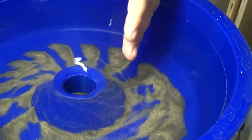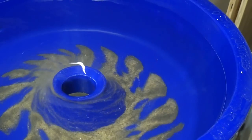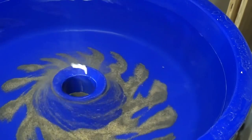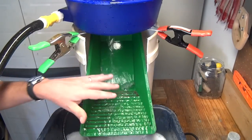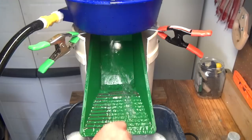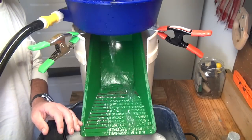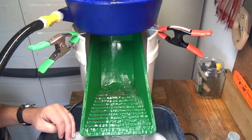You can see the material coming up the cone and out — that's all the lighter material. All the gold will stick around; matter of fact, there's a piece of gold right there, a couple of pieces. When material falls out through the blue bowl it comes down into my fossickers pan and acts like a sluice. You can see a lot of black sand caught up in these riffles. Very rarely do I have gold make it this far — I can see several gold flakes up in my blue bowl — but I'm going to add a little more material.